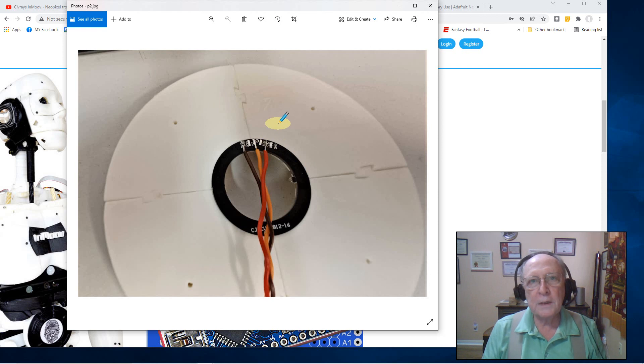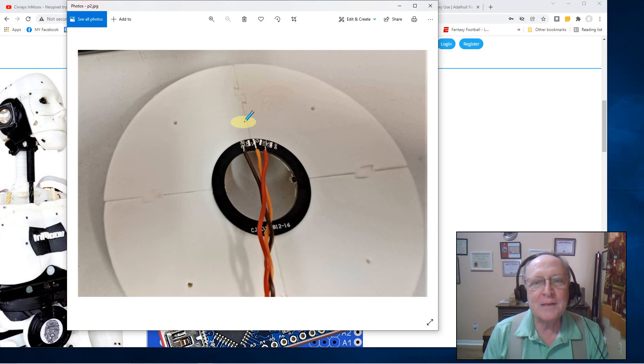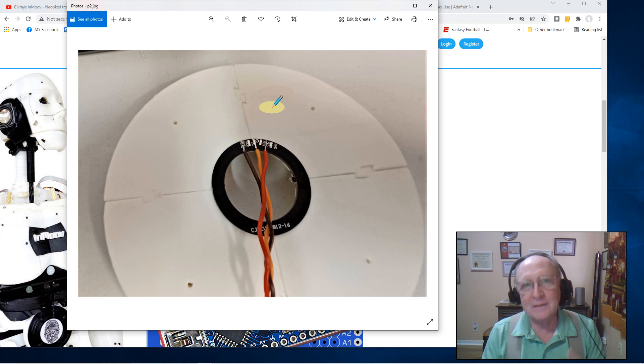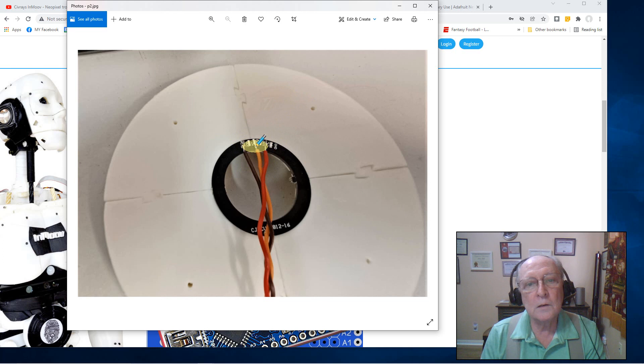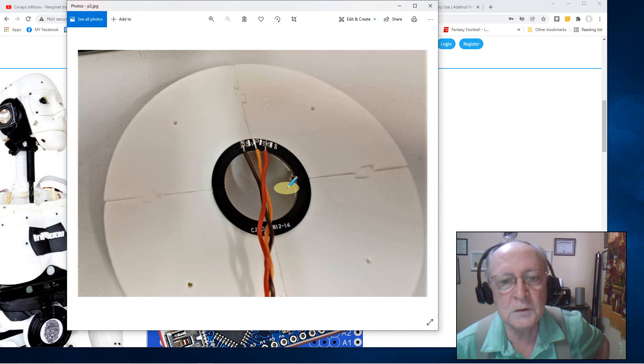Because of my tremor, I moved my wires apart so it was a whole lot easier for me to solder. This ground and this ground are electrically the same point; this VCC and this VCC are electrically the same point. The D-in/D-out daisy chains the command. I just used this to my advantage to get separation between my wires. So here are the red wires on VCC, the brown wire is on ground, and the yellow wire is the digital in. Since I'm not daisy chaining, I didn't have to worry about using the other three terminals.